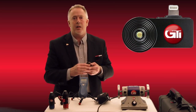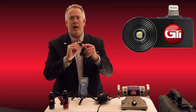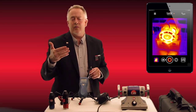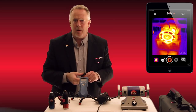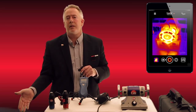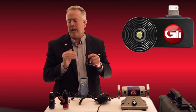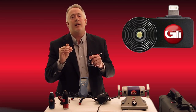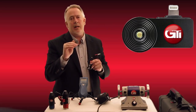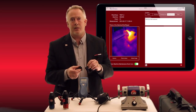That is our geometric leveling system. The next thing we wanted to demonstrate is thermography. Somebody doing a route for vibration analysis can simply clip on our thermography camera and take these beautiful thermal images you see behind me — of a loose connection in an electric box or a motor on the ceiling that we can't physically measure. Any data it collects, whether a still photo or a video of thermography, can be imported directly into ViPro to make this one seamless working system.